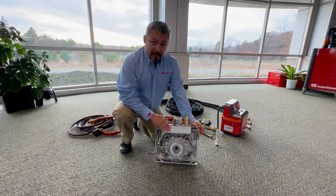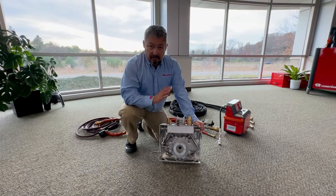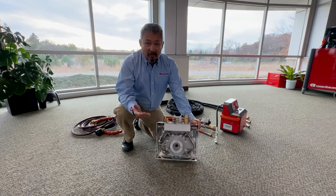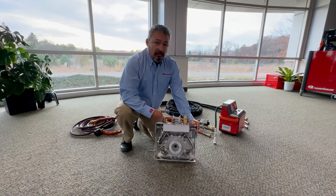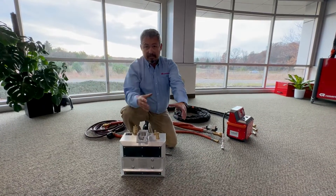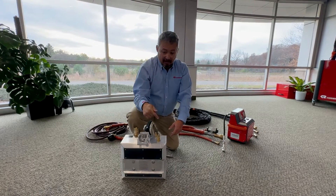A common standard operating procedure is to slide the unit underneath the vehicle, generally with assistance from jaws or a race jack — assuming tires have been lost to fire or because EVs tend to ride low to the ground. Placing it underneath may require lifting, sliding it under, and placing the weight of the car back on the unit. However, vehicles don't always land on their wheels. If access from below is impossible, one option is to invert the unit and place it inside the vehicle on the floorboard — push the seat out of the way, then use a rescue strut or hydraulic ram to push it to the ceiling, holding it to the bottom of the car and injecting into the top of the battery pack.